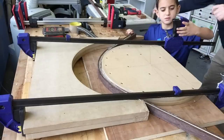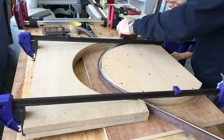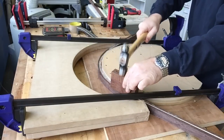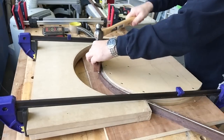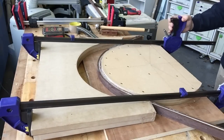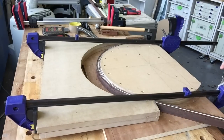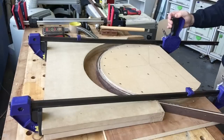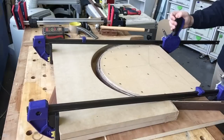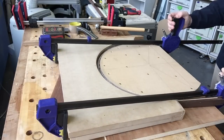Can you see it's started to come up? We need to get our block again with the hammer — sometimes the glue lets it slide. Just tap these down. It's going to make cleaning them up with a spoke shave much easier. Keep going because I've already finished my side. That's it, it's looking good. Nice and tight — that's tight.